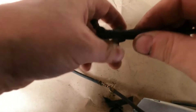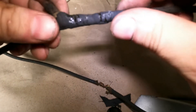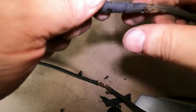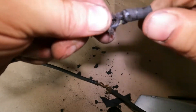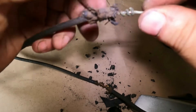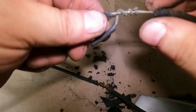Let's take a look at another one. What I did here is I saved a piece of knob-and-tube wire that had a lot of splices in it, just so we can take a look at it. So we took off the cloth tape and we have a rubber tape, which would be appropriate. So it's very old, and one might think that this is appropriate. But once we get it all apart, it's not — another loose connection that could possibly have high resistance and create heat in the wire. That's why we have so many problems with knob-and-tube.